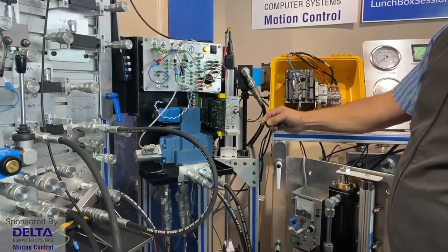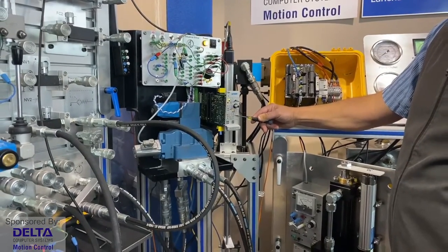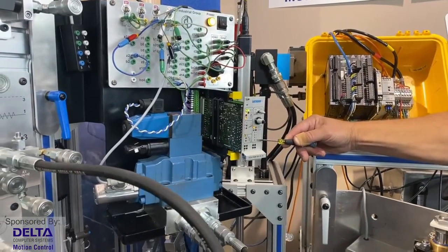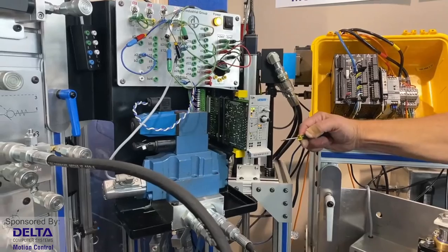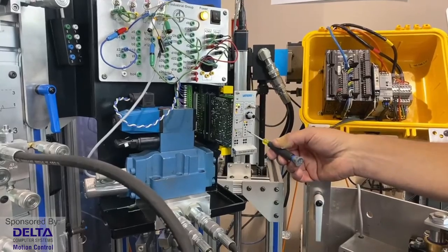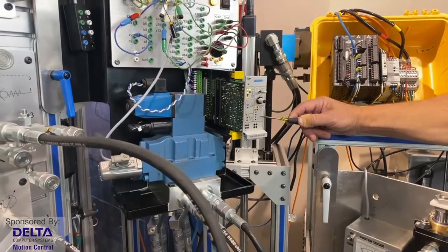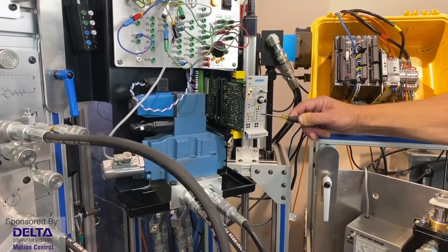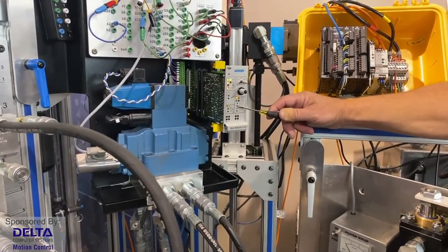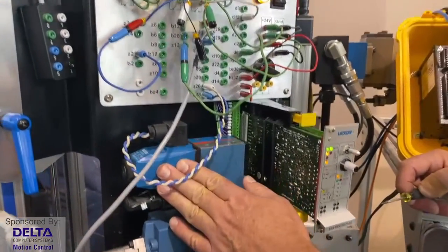Well, that is three different types of calculations or error corrections that are often done, called proportional, integral, and derivative. And there's a lot of study that one could do on that beyond the scope of what we'll cover today. But we'll just briefly look at proportional response, which is a type of error correction signal that says, hey, an error has opened up, a difference between where we want the cylinder to be and where it is now, and then we could set a proportional gain to send out a correcting signal to the drive, to drive the valve solenoid by increasing its current.